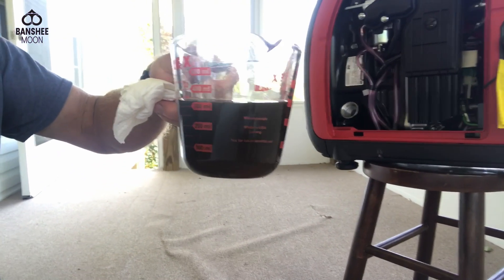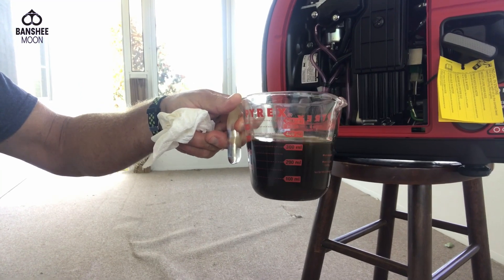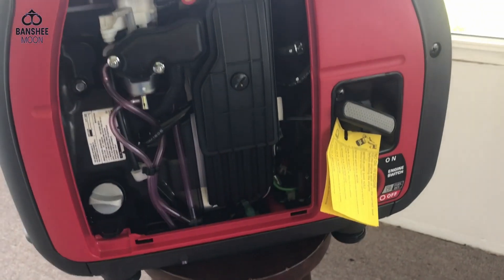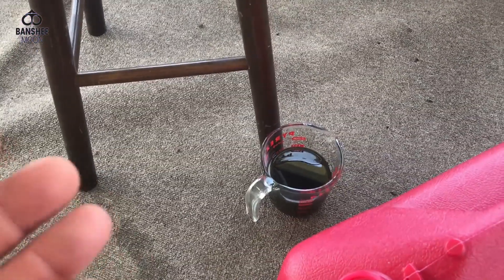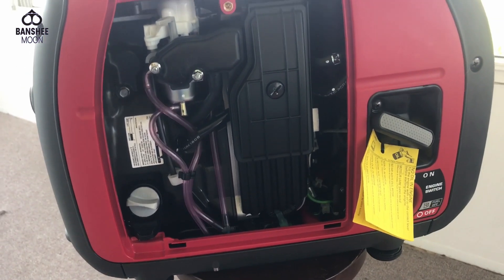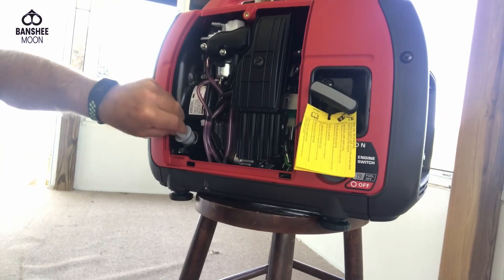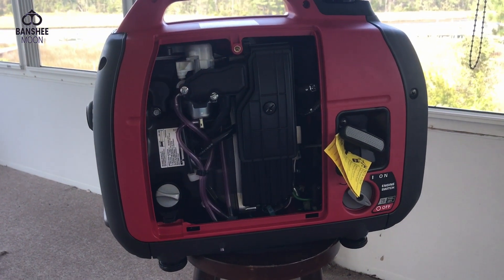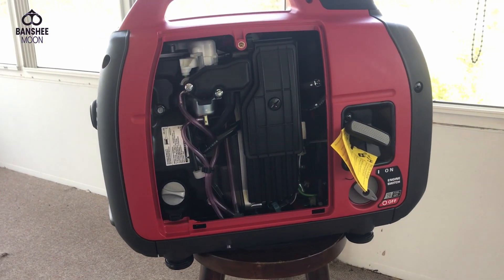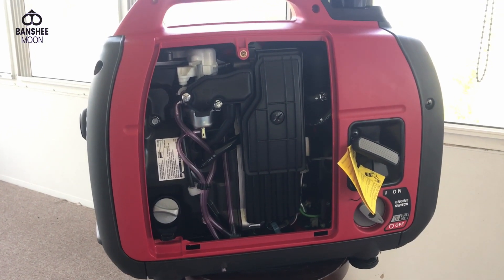I've had to repair one of these generators for just such a thing. You guys can tell me why that oil is so dark — I guess when you start them up the first time, you're going to get some particulate in there from new metal parts rubbing together. It's probably a good thing for the break-in to remove and replace the oil as part of breaking in your new machine. This one was obviously shipped with oil in it. I can only assume that's because they test the units before shipping them to dealers or the end user, which is a good thing — but in this case they didn't quite remove all the oil before shipping, which could be a bad thing, but it wasn't.